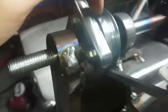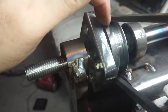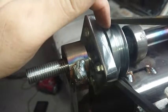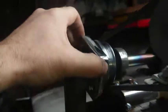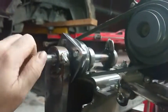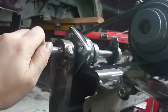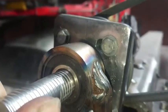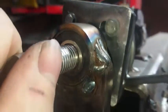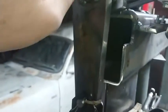In between there is a face plate from my wood-turning lathe — never used it, didn't need it, but it works great for this. Everything rotates around on that. The offset can be changed by moving the bolts from left to right, and that whole plate slides back and forth to change the stroke length.